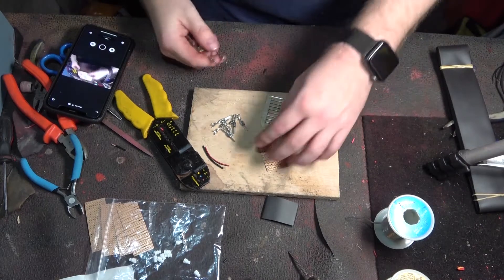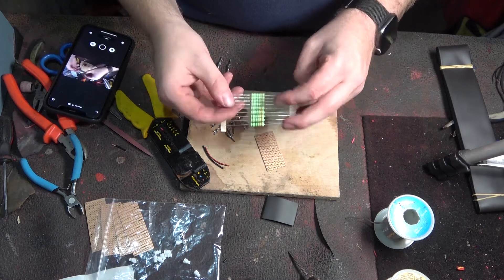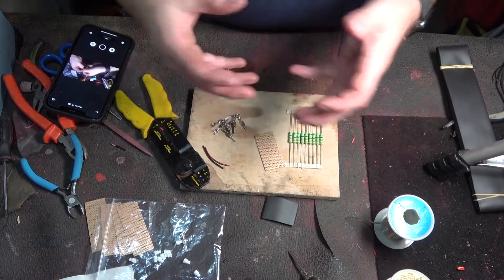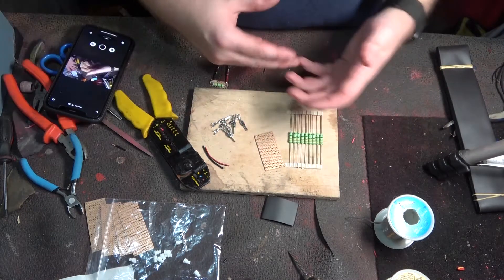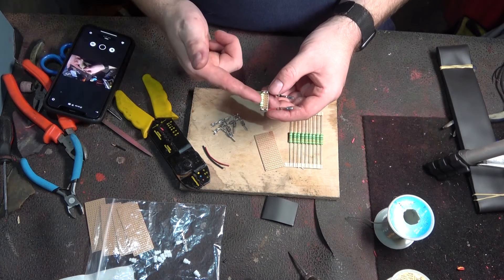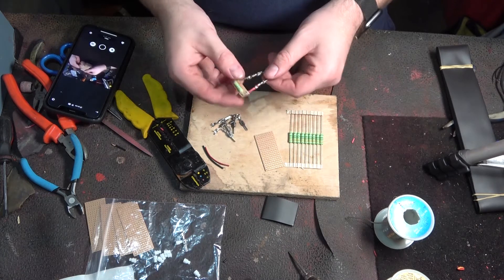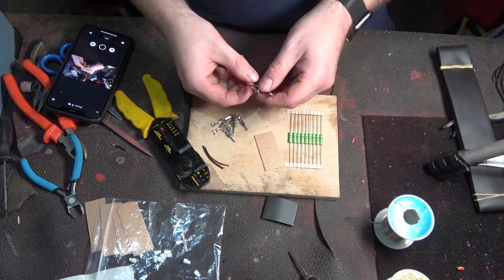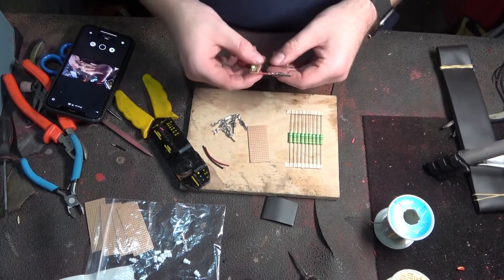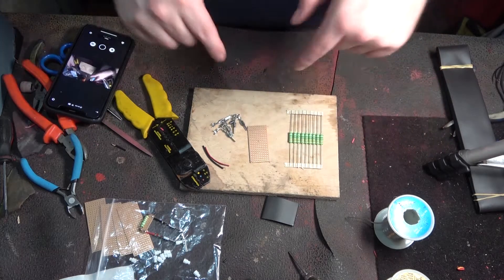As I said in the intro, today we're going to be making one of these little resistor packs. These are 330 ohm resistors and they're to stop an engine management light coming up when we unplug all of the extra vacuum lines and that sort of stuff that we don't need. I made this one earlier — this is the 330 ohm resistor and here are the two little pins where it sits into the socket. I need two of these, so I made this one off camera to get a gist of what I'm doing, but I'm going to make another one on camera so if you want to do it yourself you can. As always, there will be a list of everything below in the description.